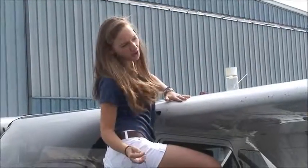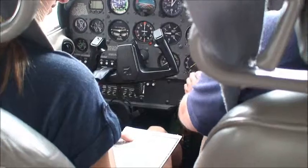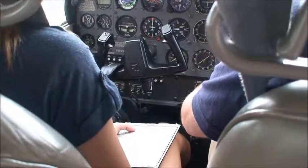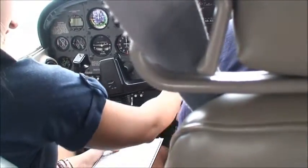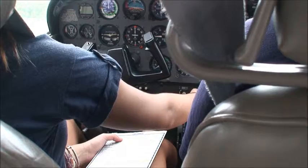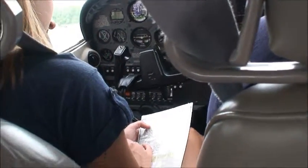It's a quarter inch. So pump it twice. How I do it is I just put my finger to the base here. I go up a little bit, slide to my finger again. Quarter inch. Put your finger to it, slide back about a quarter of an inch. Make sure full lean. So that's all the way out, right? And with this one, you need to push the button in.